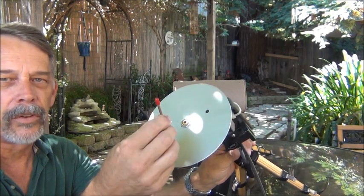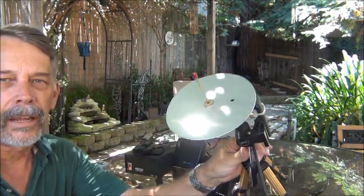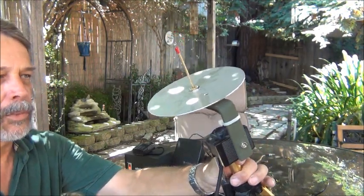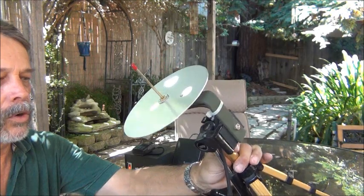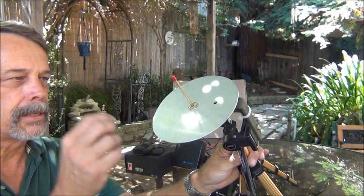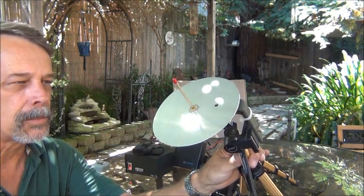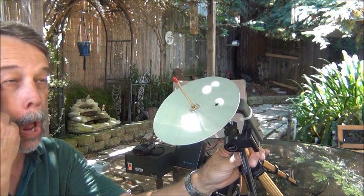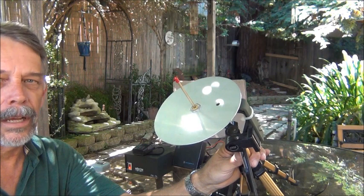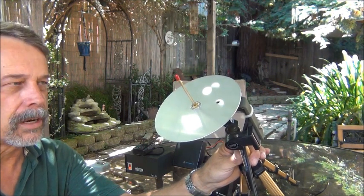You could change out this element for a different frequency if you wanted, so it just plugs in there. I don't know that you would want to use this as a permanent antenna. I don't know what the SWR on it is. Normally the radials droop a little bit to raise the impedance, so this might be 25 ohm impedance instead of 50 ohm. But anyway, it works as a test antenna here, and I'll hook it up to a 900 MHz radio and transmit on it in a moment.